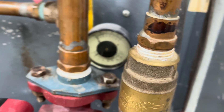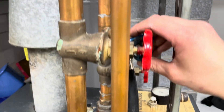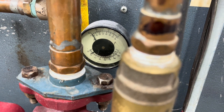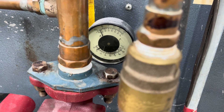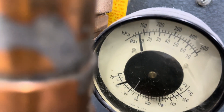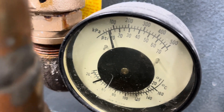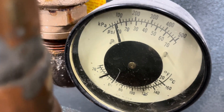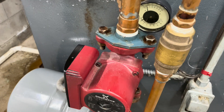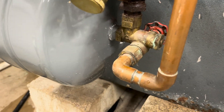I'm going to begin closing this boiler drain and we're going to watch that gauge. If you remember what the gauge was doing before, it was staying really low. We're starting to turn it and — we got pressure! We're right around 10 PSI now. I don't think it's been at 10 PSI as long as I've been using this heater, so I'm really hoping that this helps the kettling. I'm about ready to fire this bad boy back up — just fired it back up. You can actually hear the system calling for fresh water going through the Filtrol valve.